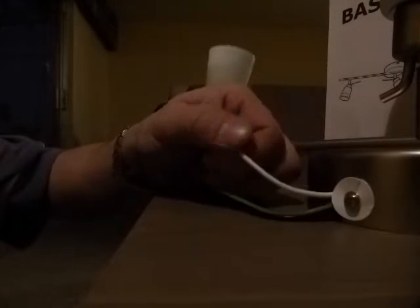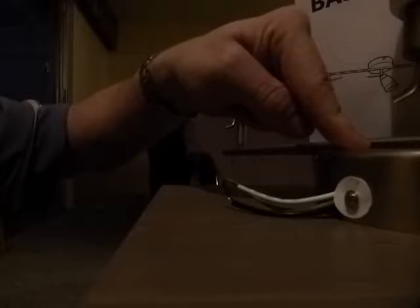Here is my wiring project. This light doesn't come with a cord, so it has three wires: a white one, a green one, and a black one. This one is actually color coded correctly — black is hot, white is neutral, and the green is connected to the ground, connected to the metal body of this fixture.